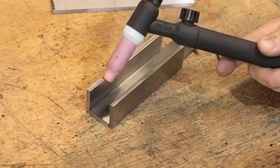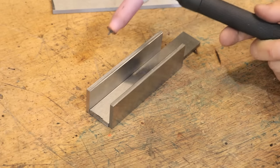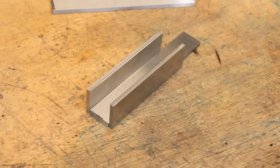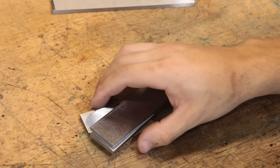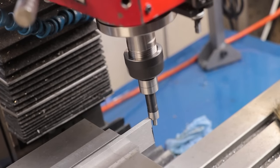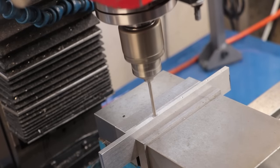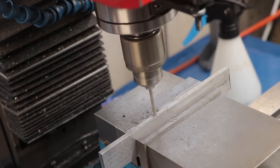Now, my first thought was I could probably weld it, but that would certainly warp the steel, and I would have to go ahead and sand it flat. I could also make a dovetail plane, that is a pretty popular option, but ultimately I decided to pin it all together. So what I did was I accurately drilled holes in all of the pieces, and they're going to be held together with pins. And in doing so, this should allow me to disassemble the plane as I'm making it, in order to figure out the next step.